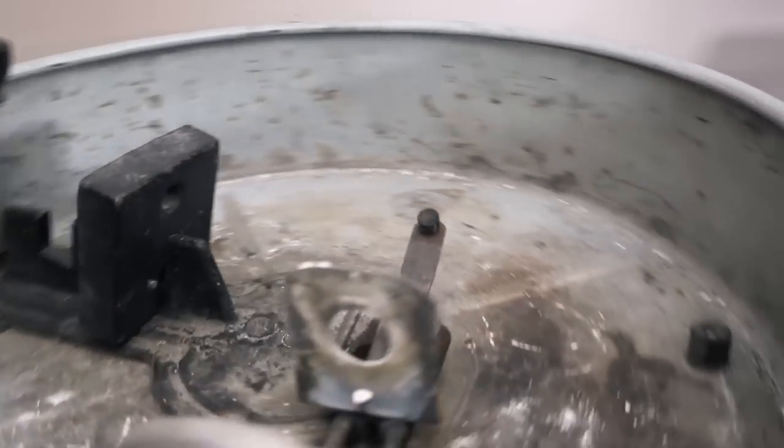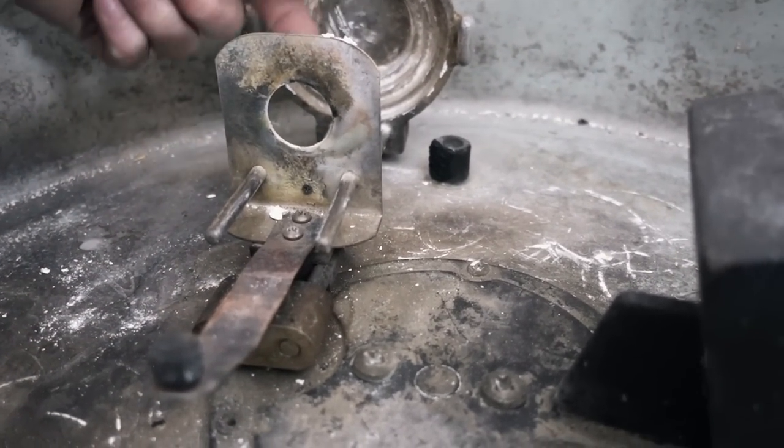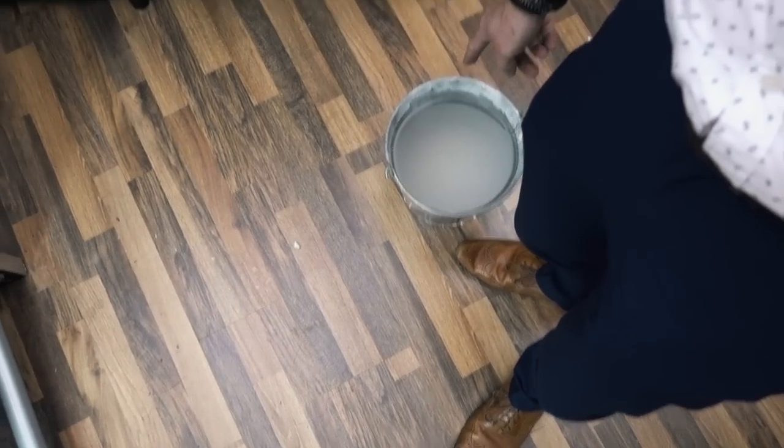What we're going to do is put the crucible in here, put the gold in the crucible, heat that up and melt it, put the flask in here with the hole facing in. When this is up to temperature we release the lever — this spins around, the arm goes whoop, it flings the gold out into the flask. Then we're going to have a flask full of gold — around about 55 grams, retail value around one and a half thousand pounds. It goes into the bucket, the investment breaks up, and we get out a little gold tree with all these little scrolls — tree of life designs.